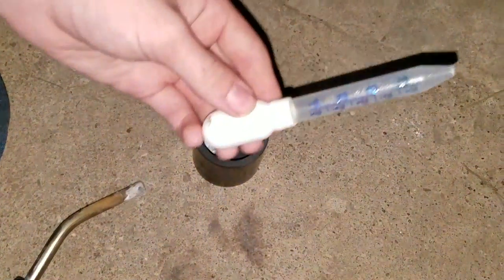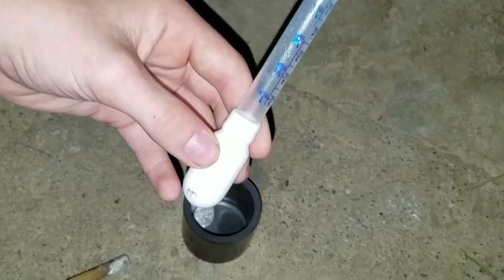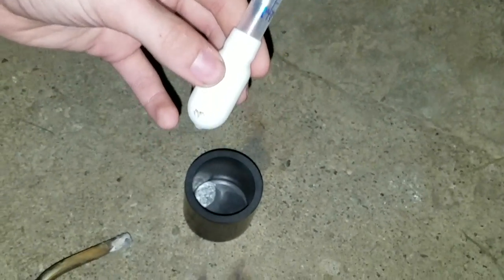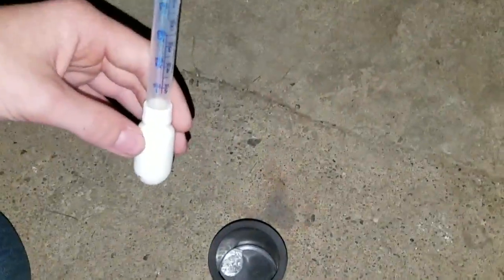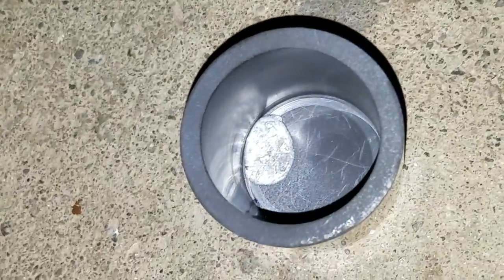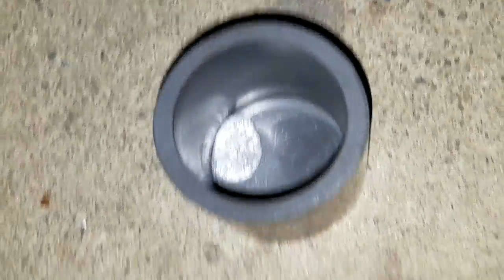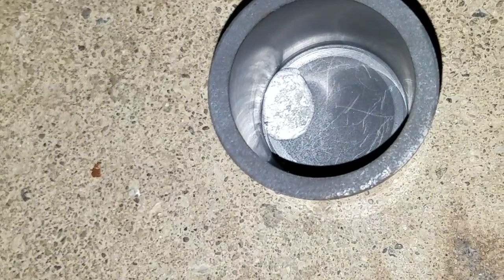It's not quite cooled off yet, but once it is, we're going to add acid, which will destroy the oxide layer. It obviously doesn't really look like a metal right now inside there — it sort of looks grayish. Once we add the acid, it'll bead up, hopefully, and turn shiny again, sort of in appearance like mercury. That's why we would be adding the acid.